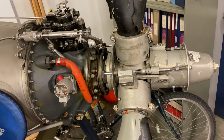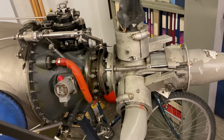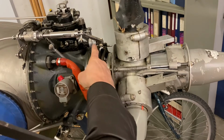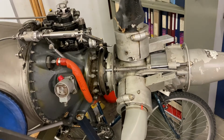Here we go. We have everything connected, and we're going to give it a go. So here's normal operation. There would be cruise kind of power coming up to just contact with the beta nuts, and as we pull the beta ring ahead, the beta valve pulled ahead right there. And that would have locked the hydraulic fluid into the propeller, and the blades would be stuck at prime blade.